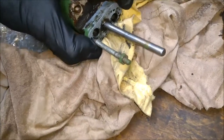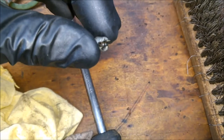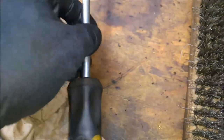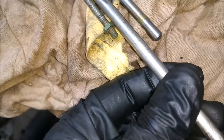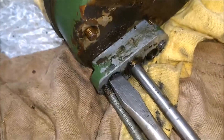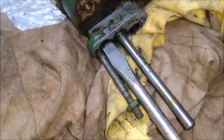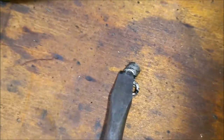I've taken the two screws out. This one on this side was fairly well stuck, and as a result I've done a little bit of damage to it, which I'm going to have to fix. When you're using a screwdriver, make sure the screwdriver actually fits inside the housing, because those nuts are actually within the housing. I was using a screwdriver that wouldn't fit inside, so the screwdriver was kinking out and slipping, causing the damage to the head there.